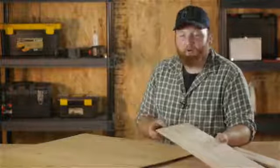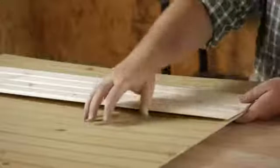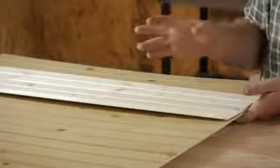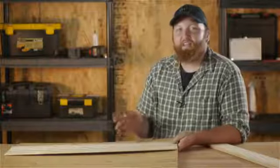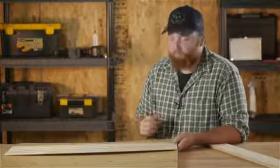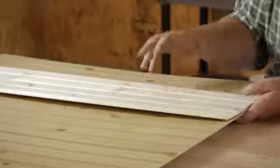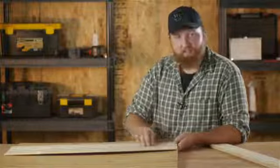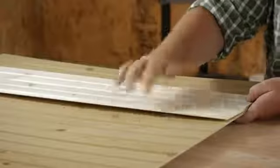A plank is just a piece of wood that you can use to put a covering on a wall. This here is just regular paneling — it comes in 4x8 sheets. It's a little bit harder to deal with, and you can't get it going to, let's say, a 10-foot ceiling without putting two pieces in there. With the plank paneling, you can buy a 10-foot piece and run it from floor to ceiling without any seams. And since it's tongue and groove, it keeps your same desired look.